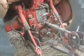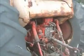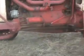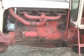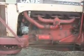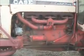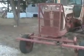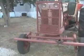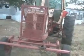The tractor works pretty well, like the lift and everything. Paid like $2,600 for it. It's a pretty good price for a fully functional tractor. No particular leaks or anything. I'm thinking it's got a bad head gasket, because there's some bubbles in the coolant, but as long as you keep the coolant up, it doesn't seem to get hot or anything, so I thought, well, probably be good for a few years, and maybe someday I'll get around to doing that.